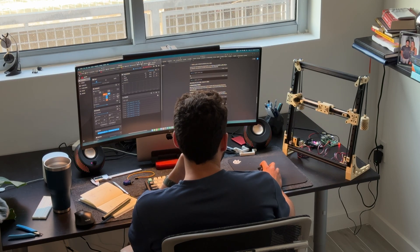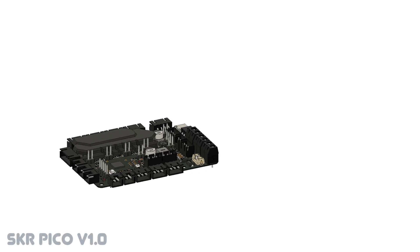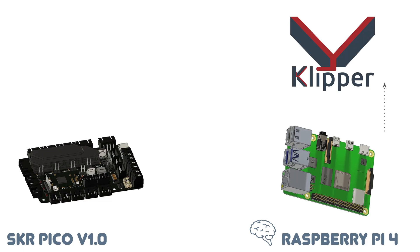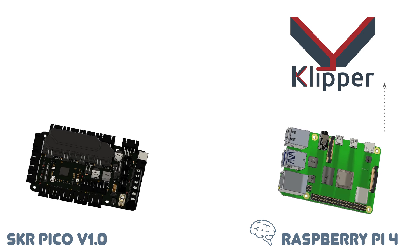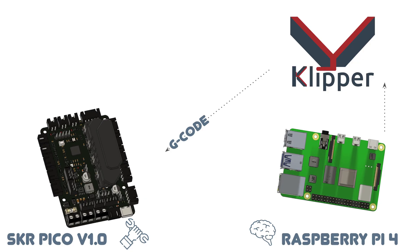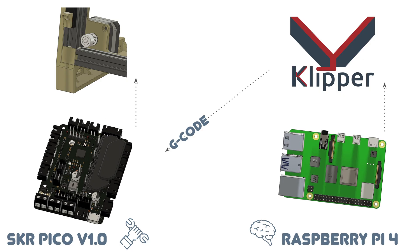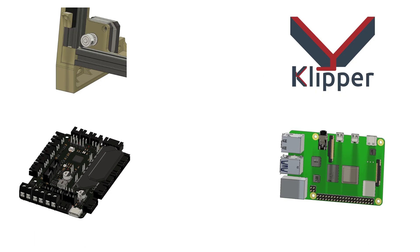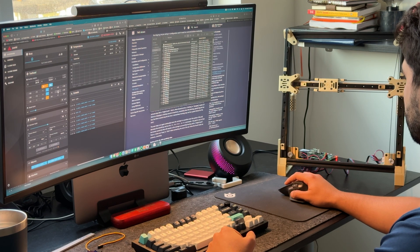With the core mechanism done, I then started working on controlling this thing. The first thing to figure out was how to communicate with the motors. For this project, I chose to go with an SKR Pico and a Raspberry Pi combo. The Raspberry Pi acts as the brains of the system — it runs a lightweight firmware called Klipper, which handles all the motion planning and coordination. Instead of doing the math on the motor board like traditional 3D printers, the Pi offloads it and just sends step-by-step instructions, also known as G-code, to the SKR Pico. The SKR Pico is the muscle — it takes those instructions and directly controls the stepper motors with built-in, ultra-quiet stepper motor drivers. This setup keeps the control logic flexible and easy to update from a web interface, while keeping the hardware lean and silent, and also allows me to talk to this thing wirelessly via custom Python scripts.